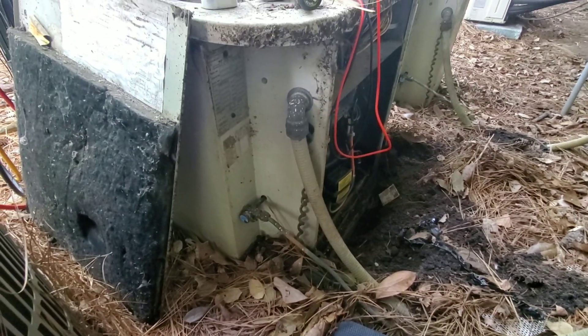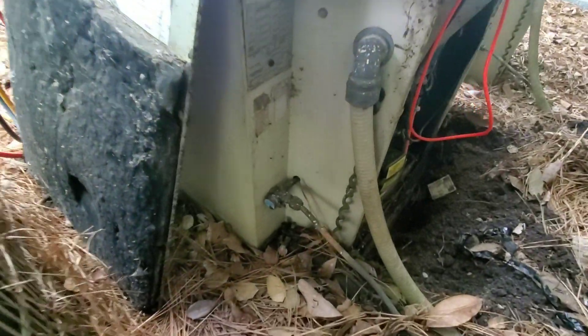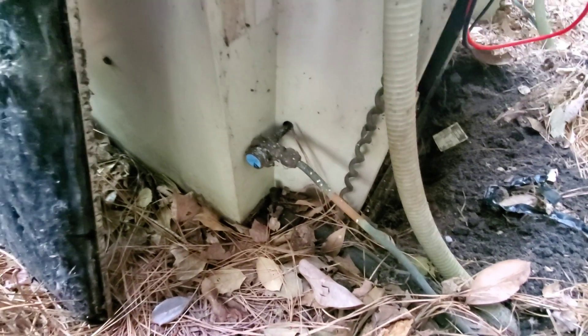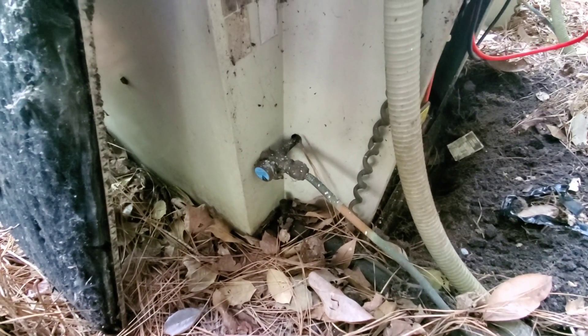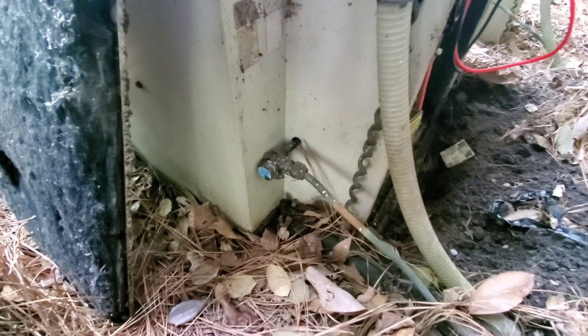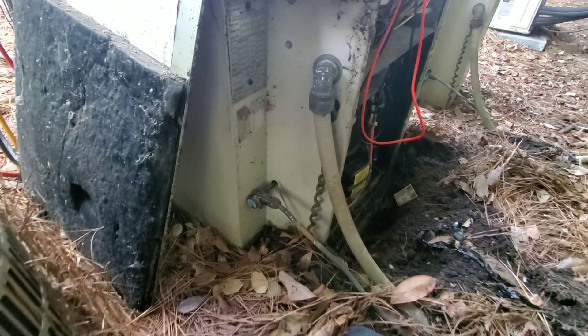They know this thing's on some borrowed time. You can see that muffler back there is rusted out pretty good, but she fires back up nice and smooth. I was going to hook up the 550s on this thing, but these are old ports here and they're facing each other, so if I happen to have a valve core leaking, I'd be in a little predicament there — because they're so close together you can't get your core tool in there effectively.